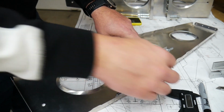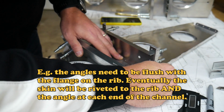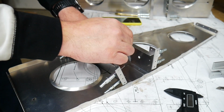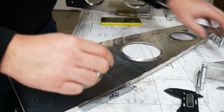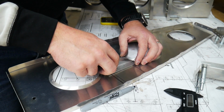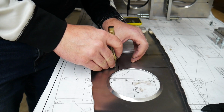So now that I've got this line drawn all the way from the top to the bottom, what I'm going to do is put the line right in the middle of my holes here. I need to make sure that top and bottom, these are lined up to where I want them. Right now they're not, so I'm going to scoot this one up just a smidge. That one's good there. Looks good there and there. And then I know that this is going to be where I drill my other holes for my bell crank. I should be able to line these holes up exactly, and they do line up, it looks like. Looks pretty good there. Pretty good on the other side. As long as I feel confident with that, I can go ahead and punch this down right in the middle, as close to that line as I can get.